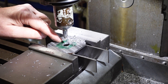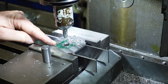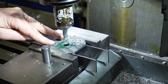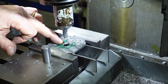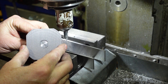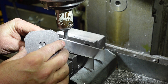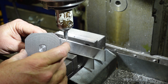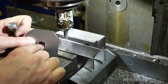Now that I've taken that material out it's just a matter of filing it up until my plug goes in, and then I'm going to try and heat treat this a little bit. It's 1040 carbon steel so it can harden up a little bit. I don't want anything terribly wonderful - I just want something that the file will skate on or at least have trouble biting into, so I can use it without worrying if my hole has gotten bigger. There's my double D hole - the plug gauge fits in there. It's no precision click fit but it's good enough for what I want. I'm now going to heat this up and quench it. I'll probably use some oil to try and get a bit more hardness, and that should give me a harder template that I can bolt onto an aluminium plate, drill out some holes, file up to the hard steel, and that'll give me my cutout.